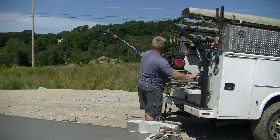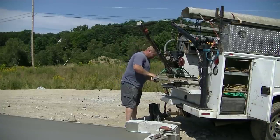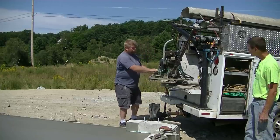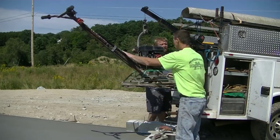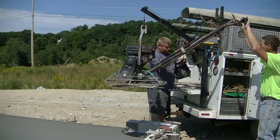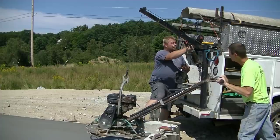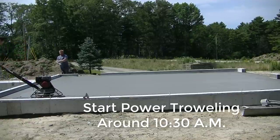Then we'll let the concrete sit and get the power trowel ready. We're using a small 30-inch power trowel today — I've got probably 10 different types; this is our smallest. Luke is putting float blades on the bottom. We like to make the first pass with float blades — it makes finishing easier, helps take out the bull float lines, fills in any little dimples or divots, and scrapes off any tiny humps. After the first pass we take the float blades off and use the finish blades. That little crane is definitely what you need — it saves your back from lifting those trowels.